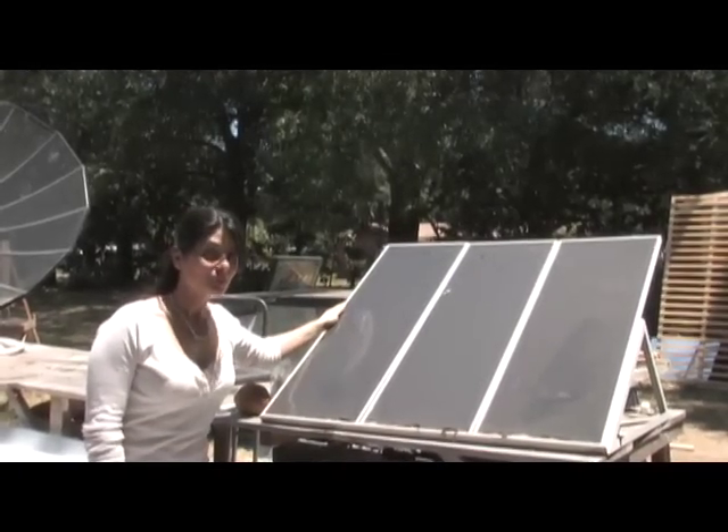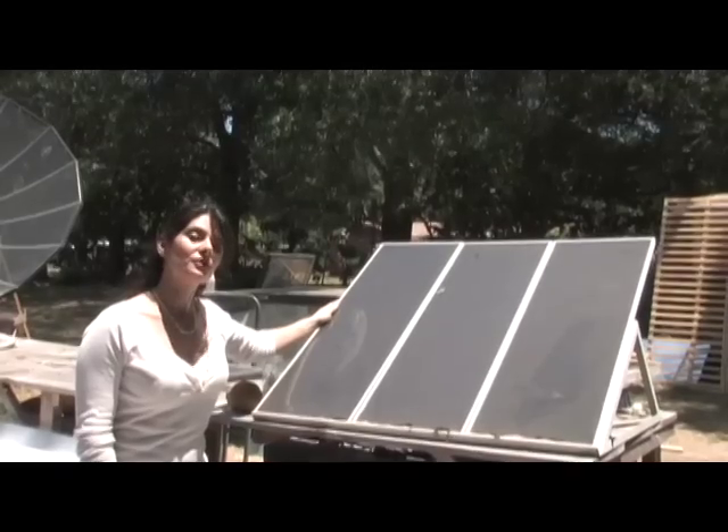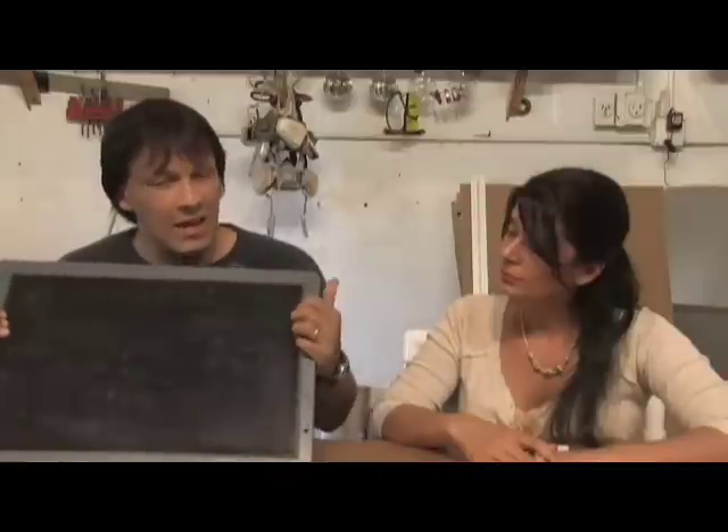This is the famous Harbor Freight solar panels that we've used in many of our previous videos. Today we're going to be using cells of a different type. There are three basic types of cells used in most solar panels. The least efficient and least expensive of these cells is the amorphous cell. This is what the Harbor Freight system is — the cells are deposited on glass usually. There are kits that come with this; they're really tricky to work with. I pretty much don't advise you to try to make these.